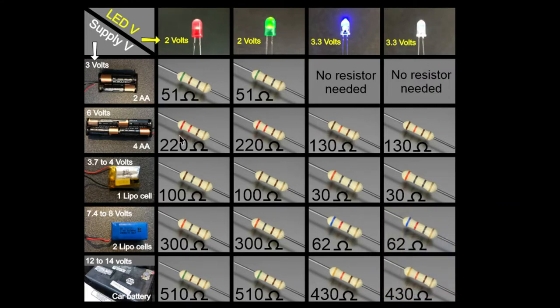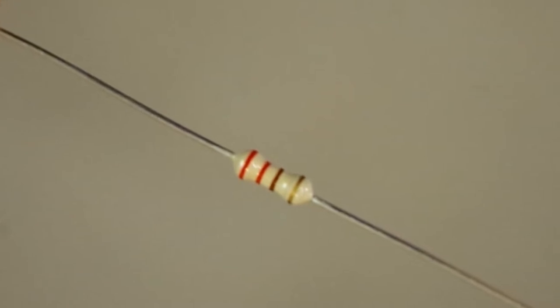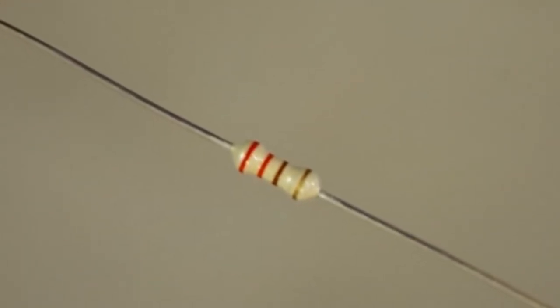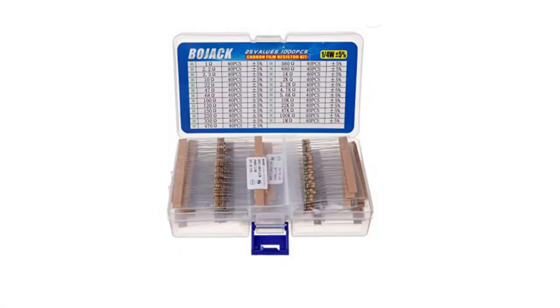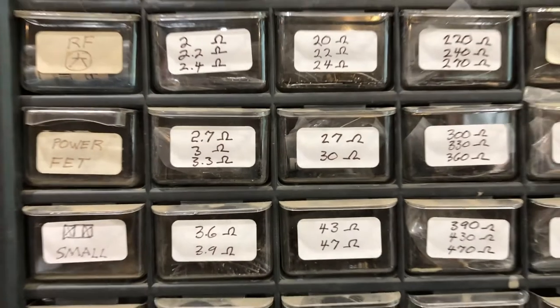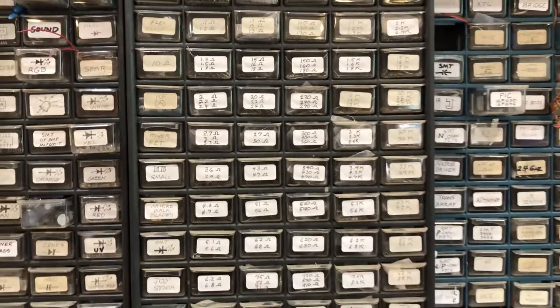Using the cheat sheet, you can pretty much get any low power LED to work — maybe not at its absolute best efficiency or best for a really long life, but working well enough. You can figure out the value of the resistor by looking at the little color bands. There's a handy web resistor color calculator — the link is in the description. I recommend getting a selection of resistors if you plan to use more than one. They're super cheap, and a selection like this one is the way to go — it's like 10 bucks. I organized mine in a drawer cabinet so I don't have to look at the little color bands every time I need one.